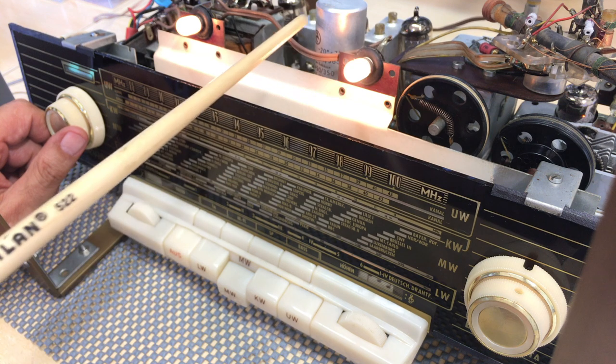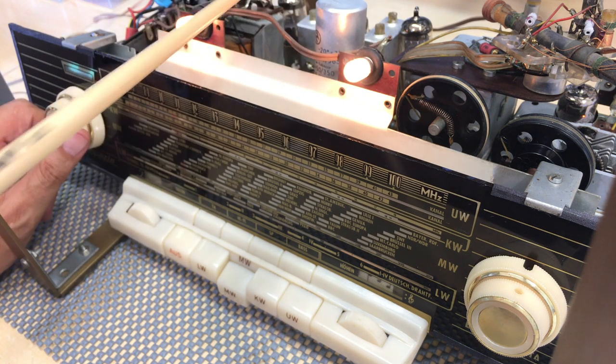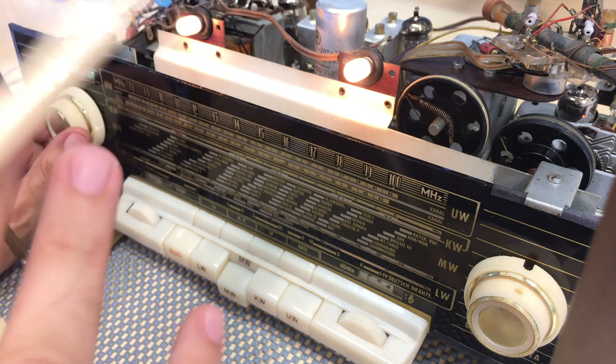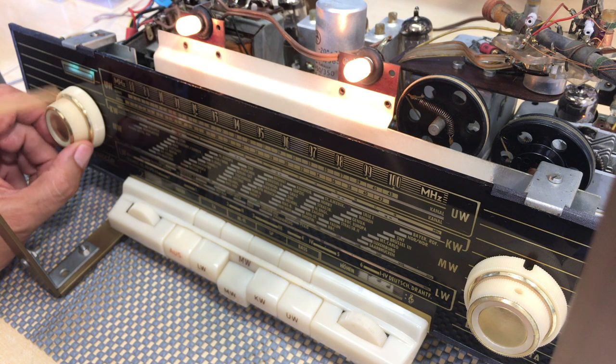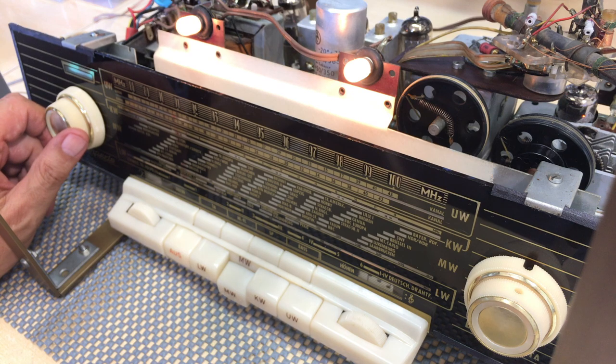And if you've got a weak signal, it'll let the gain of the previous stages stay quite high and make the results a little bit stronger. Automatic gain control, right? So we need to make this signal as small as possible. But as I said, doing this with a signal audible is a pain in the butt. So I prefer to put a load resistor on there.